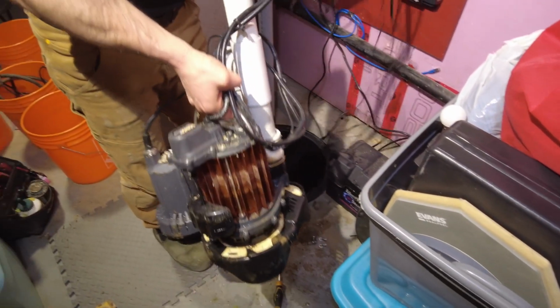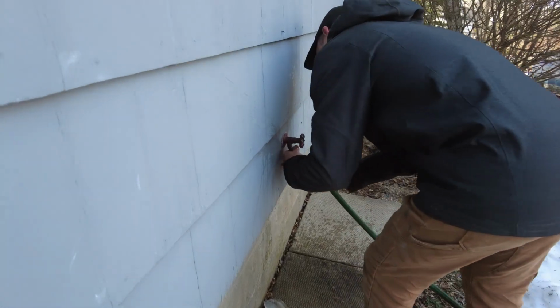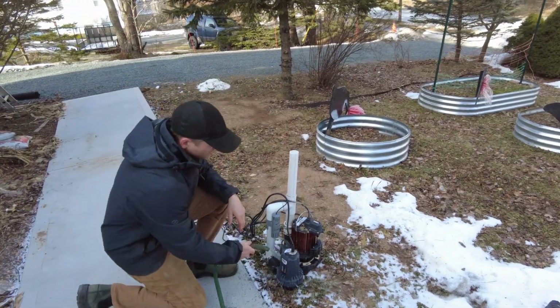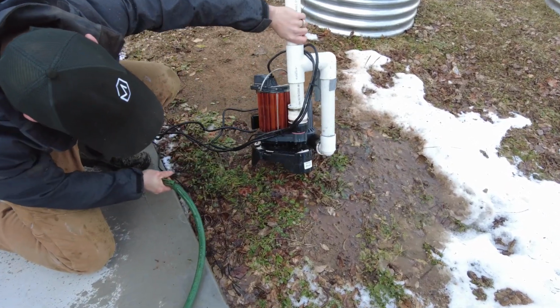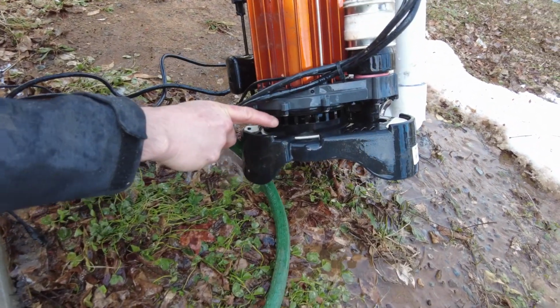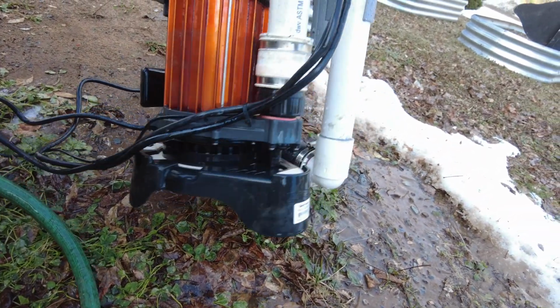After the basin is clean, it's time to clean your sump pumps. You can either do this inside of a laundry tub or with a garden hose. It's important to make sure that all the dirt and debris is off the sump pumps. The impeller screen where the water is actually sucked into the pumps is especially important. Inspect it for any obstructions.